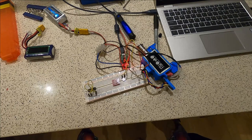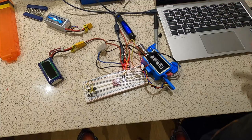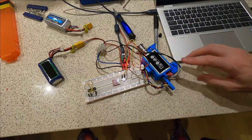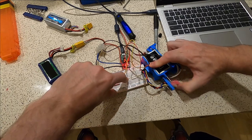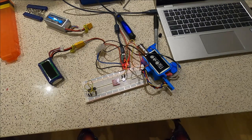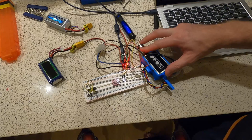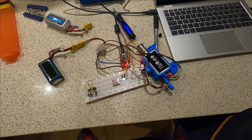Switching from a 4S battery to a 3S battery without changing any timing in the program - the program isn't reading battery voltage at all - shows it dropping to 13 DPS, then as low as 5 DPS under load. Just by feel, the 3S generates significantly less pushing power than the 4S against a double-spring setup. With a simple fixed-timer arrangement this would cause reliability issues, but the closed-loop system automatically adapts - it takes longer when there's less power, and that's captured naturally through position feedback.